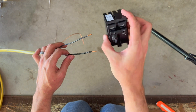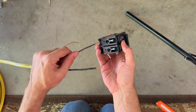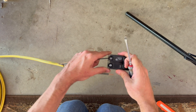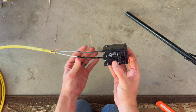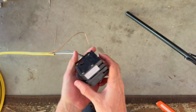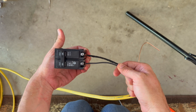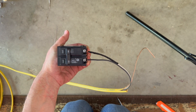So now they're both hot lines. On the back side of the breaker — this is the part you'll see — you're going to hook one black wire underneath this part of the breaker and tighten it down, making sure it gets good and snug. Do the same thing for the other wire. Now you've got both wires firmly in there, with the ground attached to the ground bar. You'll hook the back side of the breaker in like that, snap it in, and you'll have your off and your on positions.